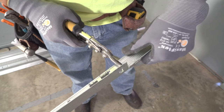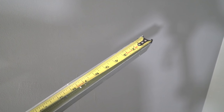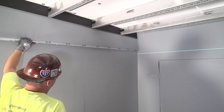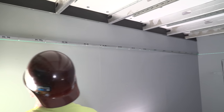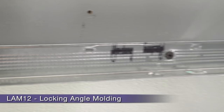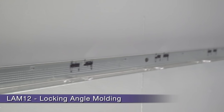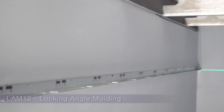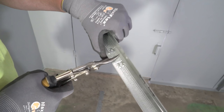There's a little indent in the hem marking the center. Our first locking tab will be 8 inches off the beginning of your first run of angle. You will notice 4 inch on-center rectangular holes along the top side of the angle — these holes serve as a point to easily place your first screws. You are free to place your screws wherever you want on the vertical leg of the angle; many installers use the four inch on-center holes as a layout guide as well.